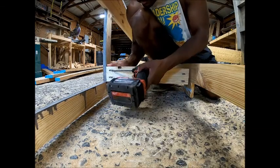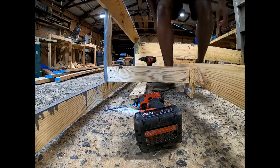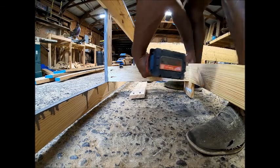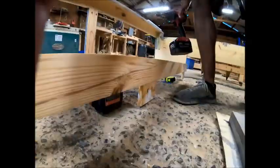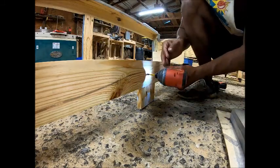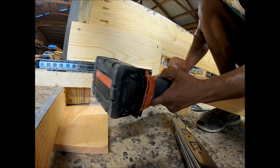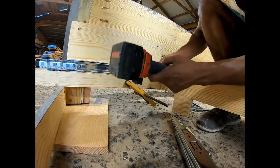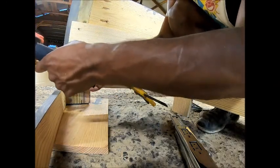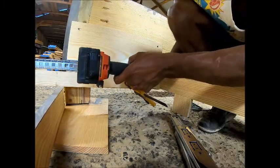Make sure the middle pieces are lined up with the bottom runner to keep everything in line. Make sure those little feet are the same height as that runner across the footboard. Measure the distance to make sure the opening in the back and the back of the drawer are the same width. Then attach those with pocket holes, add the extra screw to hold them in place.